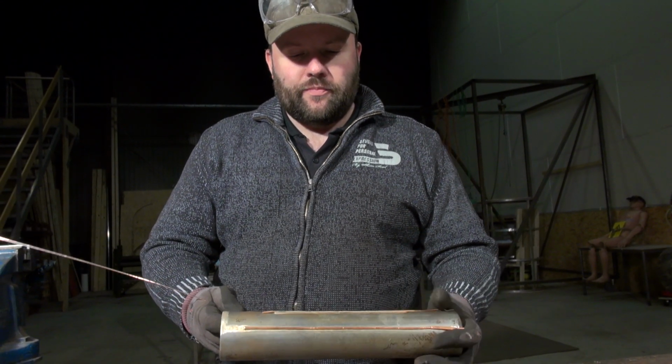Now, the second thing is we have received some extremely valuable help in that we have received silver solder material in strip form. That is a strip which is approximately 0.2 millimeters thick and about 5 millimeters wide. Now, the main problem we have had so far is placing the silver solder material correctly when we are doing the soldering process, because it's shut and sealed inside an oven and we can't get to it. We can't apply silver solder material manually anywhere. So everything has to be completely pre-packed and then heated and soldered and cooled off, and then everything should work in that process.